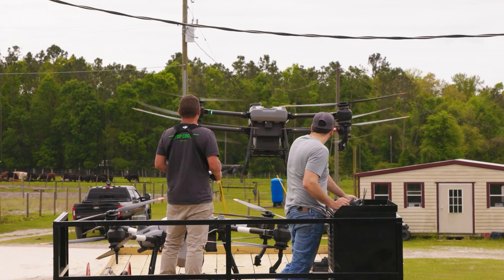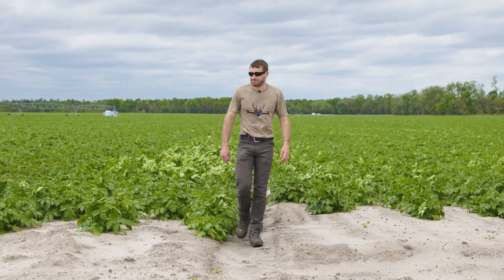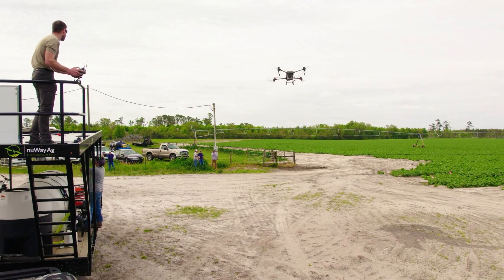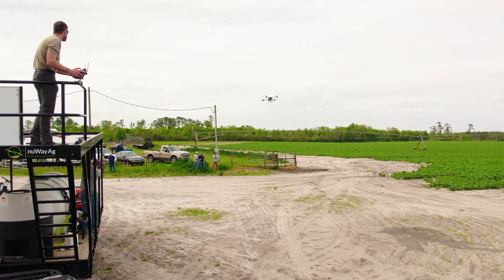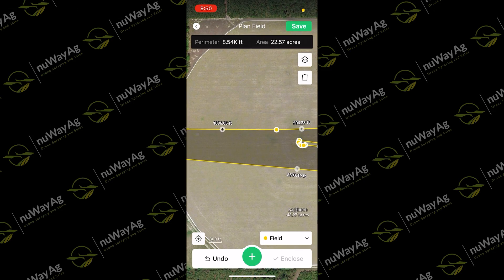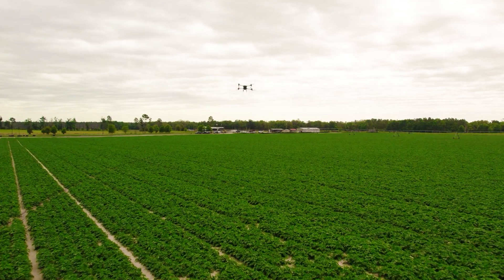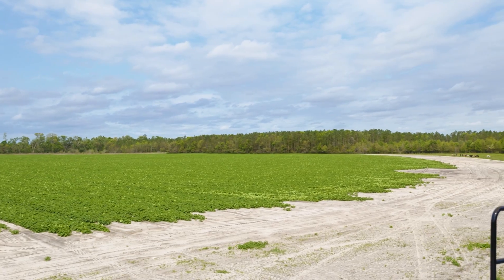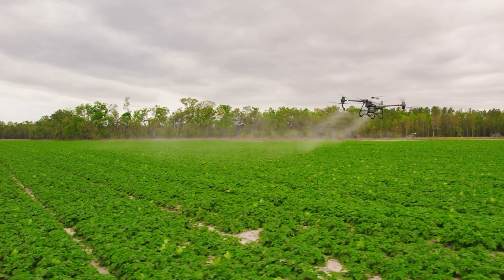All right guys, we got this field wrapped up. Doing a demo out here on potatoes — had some farmers, had an aerial applicator with airplanes out here as well, wanted to see these drones in action. It went really well. No real obstacles. The only one we had to figure out was the pivot — we took a T40 off, went over, marked the pivot, and figured out the pivot was in the same position it was when the aerial photo was taken on the satellite we were working off of in the DJI app. Once we got that figured out, we sent drones up on the top side. After building boundaries and talking to the farmer more, we figured out they don't plant all the way out to the fence. We took the pivot tire track and built the boundaries right to it, so it's really precise — you're not using extra chemical.